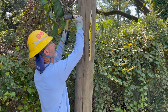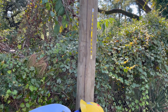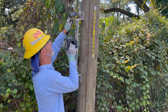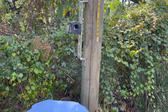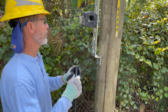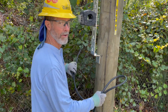What we're going to do is, up on the pole, we're going to hang the CTs — the CTs are going to be right here. This is kind of a mock installation to give you a picture of what's going on. So the CTs are going to be mounted on the pole like this. I'm going to give the serviceman 30 feet of cable, stripped, and he's going to mount it right on the side here where we can wire the CT. I'll show you all next how to wire it.